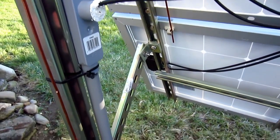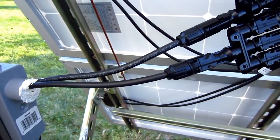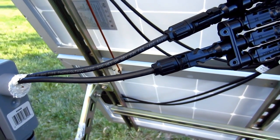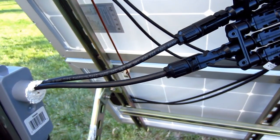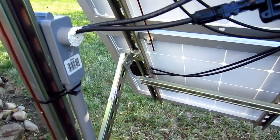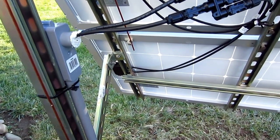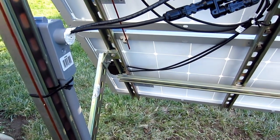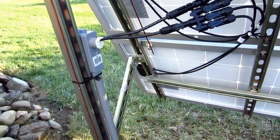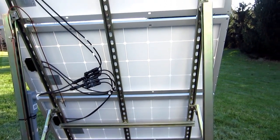This PV cable — photovoltaic cable — I cut that in half and ran it through this schedule 40 three-quarter inch PVC. That's not actually required because this cable is THHN/THW-rated, meaning it'll withstand heat and moisture. I bought a 30-foot section, cut it in two, and ran those cut ends through the PVC. Here's a good tip: make sure you run that PV cable through the conduit before you actually glue the conduit, otherwise you'll never get it through.